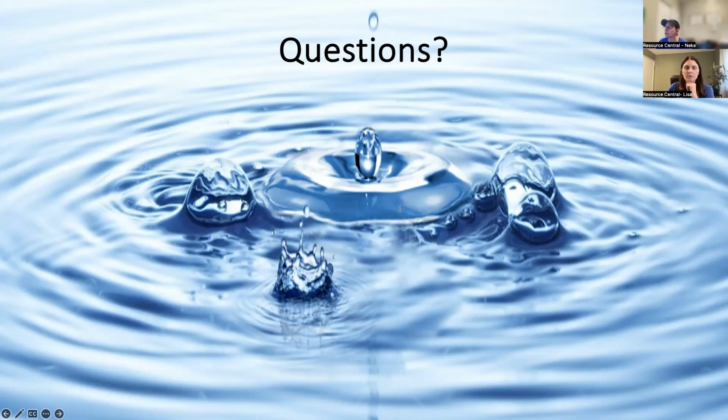All right. So here's another one that just came in. If you do have a zone that's part garden and part turf, can you leave the grass sprinklers and just convert part for drip? Yep, like I said, that's kind of the alternate solution if it all is one zone. Sometimes you can split it if you have space on your clock, basically, for another zone. But again, that's a little pricier and a little more extensive work. But yeah, you can convert just one head to a drip.